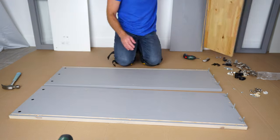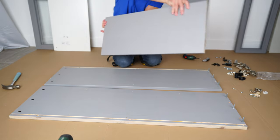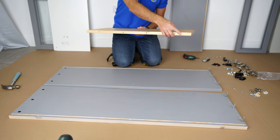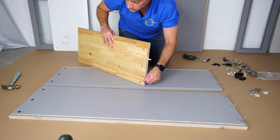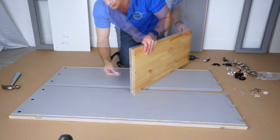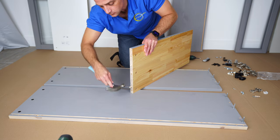Now we're going to need this bottom panel. One side plain, one side colored, front colored, and back plain with the holes. Two wooden plugs on each side — place them in. Watch out for the holes when I'm putting them in — do exactly the same and you're going to be fine at the end. Secure them in with the hammer.